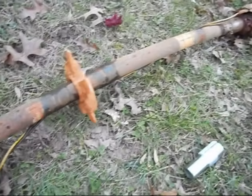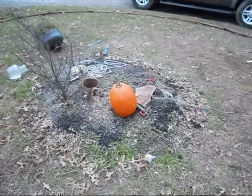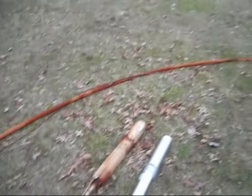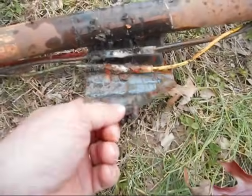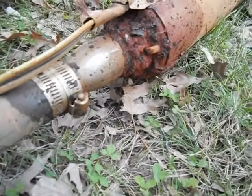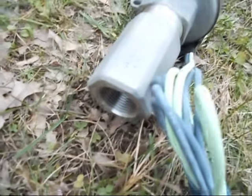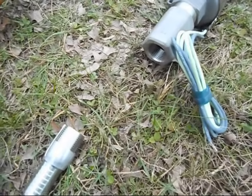Here's the wire coming up from the pump and the shrink fit. Those are the wires that go all the way up around and eventually come over to the well head, down through the house and back to the house. So we're going to disconnect those, use this new kit, wrap it back on, take off the stainless steel connector. Actually, I'm going to use this new one here, connect that to the check valve on the new pump. We've got a couple brackets too that will hold that on.